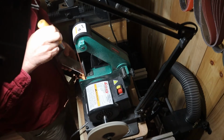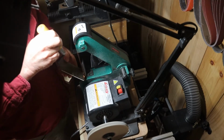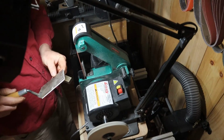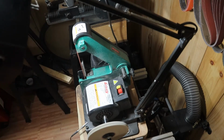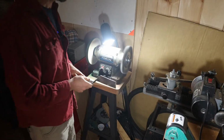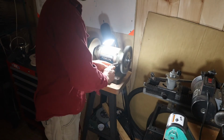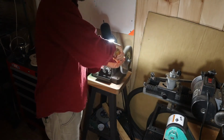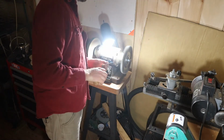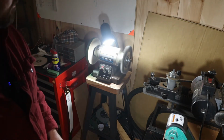They wanted this square and the points to be corners. So without grinding a bunch of material off to bring back any rounded corners, I did what I could to keep them square. Again, back to the wire wheel, nothing fancy here, just pushing the burr back to the bevel, down one side, down the other side. You can see the burr go right back over.